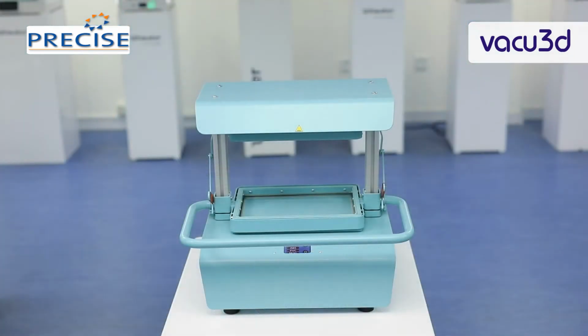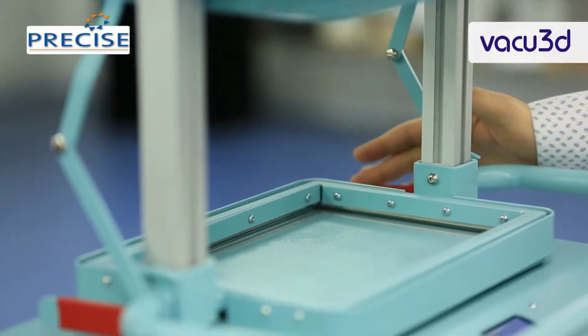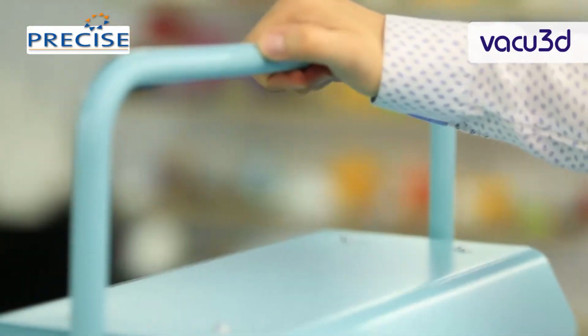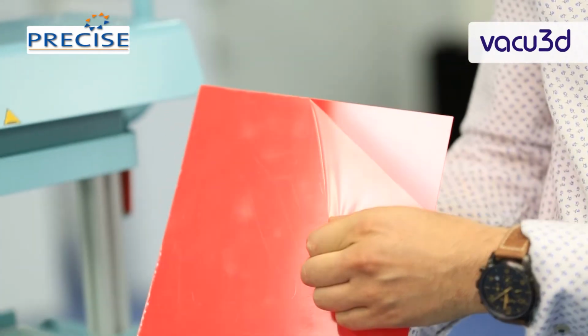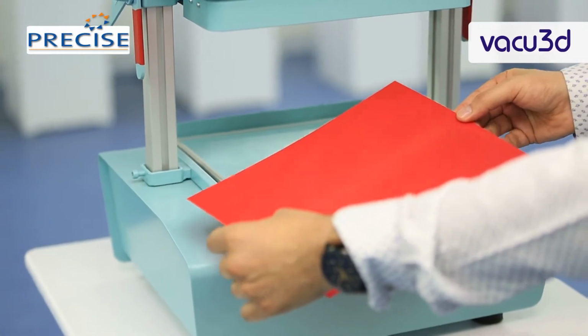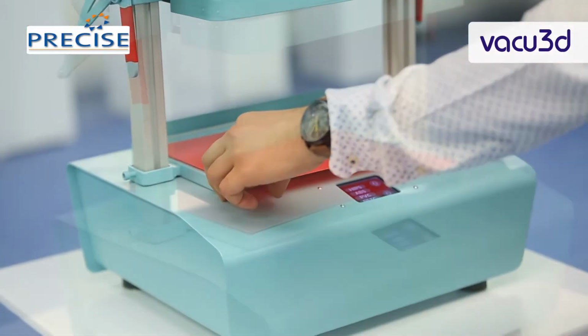To start using the Vacu3D, first open the frame by turning both locking levers backward. Then lift the frame up using the handle. Remove the protective film on the 1mm HIPS sheet. Place the matte or glossy side facing up, depending on the surface effect you want to achieve.